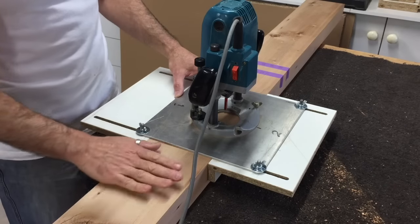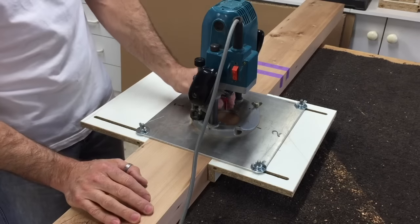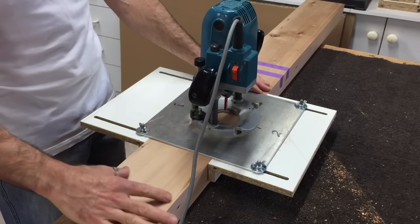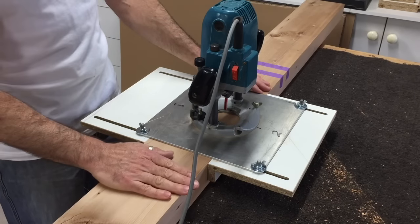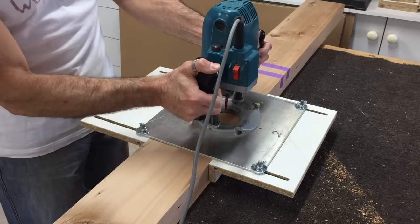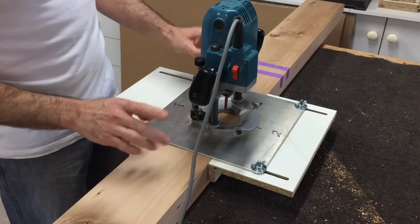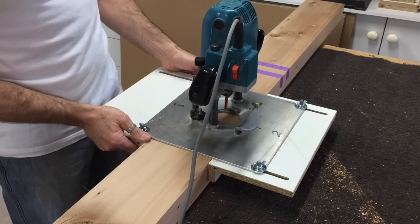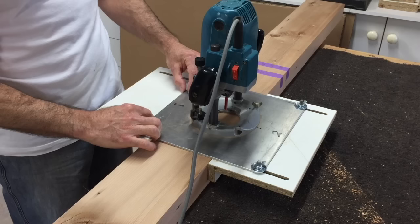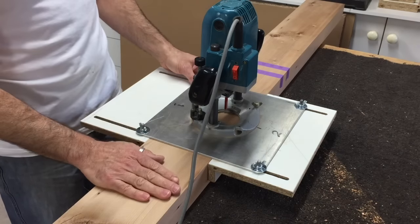What I'm going to do now is rout five grooves into the face of this beam — almost the full length of the beam. I've got my 8mm or five-sixteenths bit in my router, and I want those five grooves to be spaced evenly across the face. Unfortunately for the two outside ones, I can't get my router quite far enough across because of the width of the beam. So for those two only, I'll take one side of the mortising jig off and clamp a strip of timber right on the edge of the plate. Then I can use the full jig to do the three centre grooves.